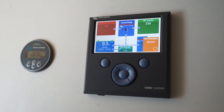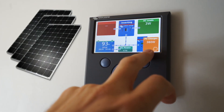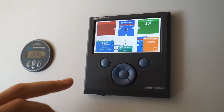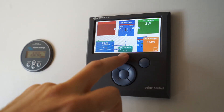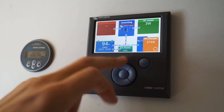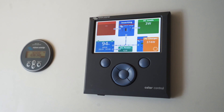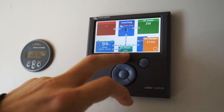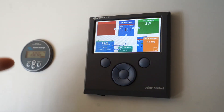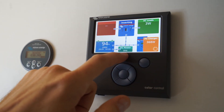In my system I've got several components shown on this overview screen. We've got the solar panels currently generating 380 watts. We've got the battery which is currently 29 volts. There's a little box here for DC power — that's an option you need to turn on. When you first get this control panel it won't have DC as an option. Because I'm running a DC system with lights and everything, I've turned it on and it shows you separately how much power is being used. It works out what's left over — if it's not going into the solar charger and not going into AC loads, any power going out must be DC power.